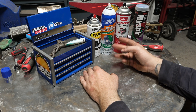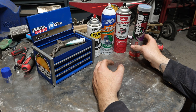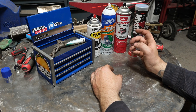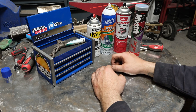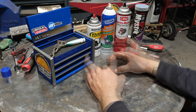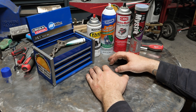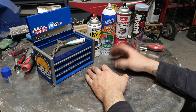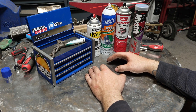It's not worth the potential health risks of using cleaners that, when vaporized in the arc, could potentially kill you. Clean the grease up the best you can, and you should probably be wearing a respirator of some sort anyway to keep particulate out of your lungs — but remember, not all respirators can protect you against paint and grease fumes. Welding in general isn't the safest hobby or career, so you're better off taking extra precautions and keeping it simple: acetone or soapy water on a rag. It also doesn't hurt to use a wire wheel on a grinder to clean off paint if you can. It's not worth breathing the fumes.